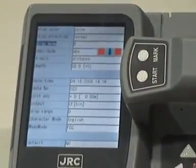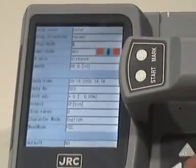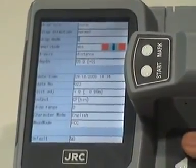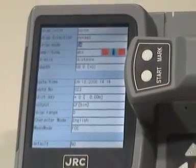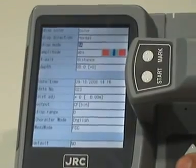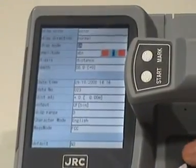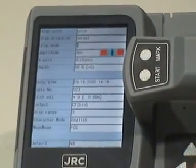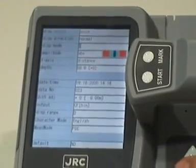The next option is the display mode. You have two display modes. The first is B, which is basically a B scan — almost a snapshot through the concrete. If you select B, A scan, you have the B scan as well as the A scan, the A scan being the trace of each pulse as the radio waves go down into the concrete and come back up. Generally we keep it on B because it keeps the screen less cluttered, although BA can be quite helpful when you're having trouble finding your targets.